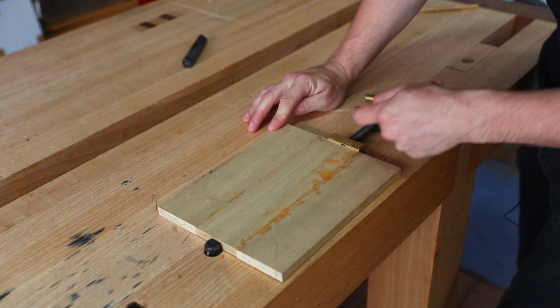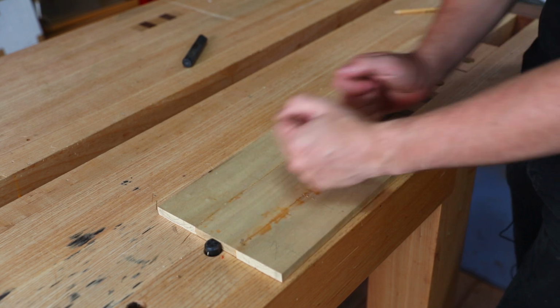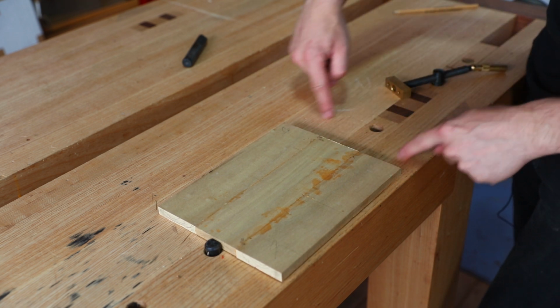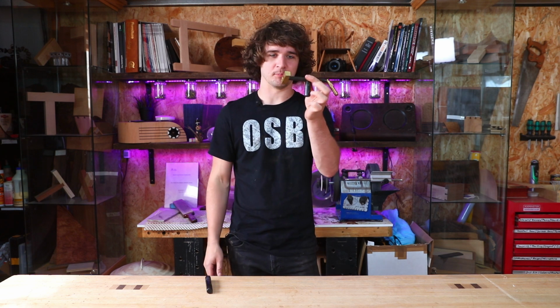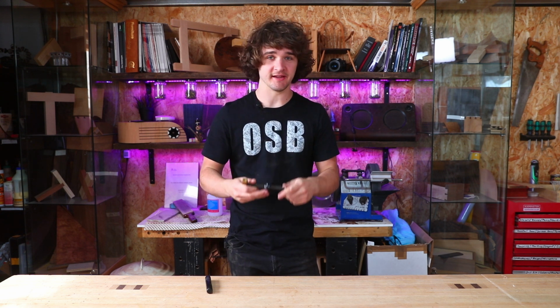Now you can see with this, the disadvantage of the Wonder Dogs is that the height is fixed and they may sit above the surface you're working on, thus you won't be able to plane it flat very easily. So instead, just shift this back a hole and then clamp a thinner bit of material between here going up to the edge of the lid, and then you'll have lots of room around it in order to work on that surface. So I'll pop a link to these Wonder Pups and Wonder Dogs in the description and also in the supporting resources if you're watching this on the actual online school page on my website.